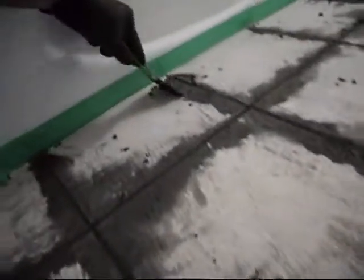Look at that, full tile landed right against the door sill. Tight to the door sill. Crazy, huh? Pure luck. And the room is square, that's even more amazing. Doesn't have to be perfect because when you run over it with the sponge it works it into any spots that you missed. Now I'm wondering, should I fill the gap between the tub and the tile? Tubs move. And if I put caulking in there, the caulking is just going to fall into the gap. I should put a foam backer filler rod, which I don't have with me.